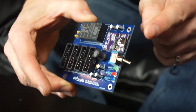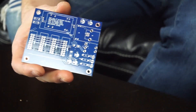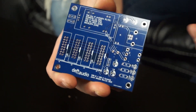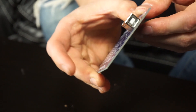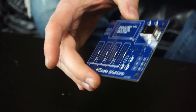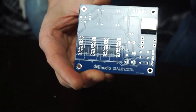This case is USB-C, but I can take exactly the same board without any changes and instead populate the USB-B module, giving a USB-B connector. Obviously in that case it's only 5 volt — there is no intelligent communication — and it goes straight to the DC-DC module.